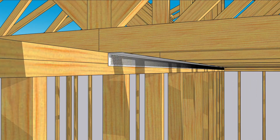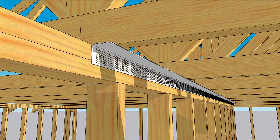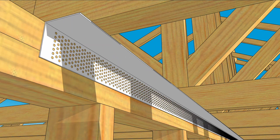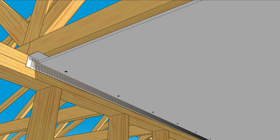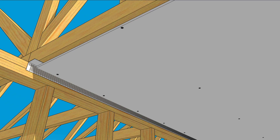A stronger way is to use a vinyl truss backing angle, which allows the wood movement and holds the angle together tighter than paper tape and joint compound. The ceiling drywall is fastened into the backing angle at the edge and into the truss about 18 inches back from the edge, where movement is less pronounced.